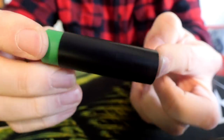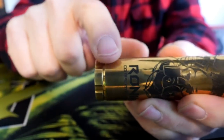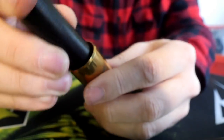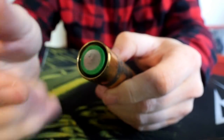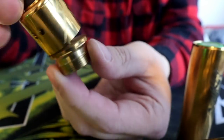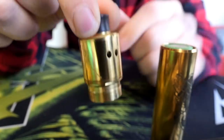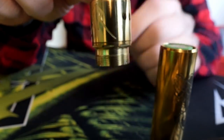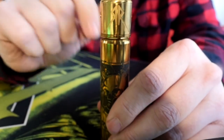The one exception to always running batteries right side up is if your mech mod includes a protection sleeve — whether plastic or delrin — to protect that battery wrap. With the Ronin's nice threads, screw the switch flush, press that delrin piece all the way down into the tube — it's a very snug fit — then drop the battery in positive side down. The delrin ledge physically stops the battery from coming out the bottom; it can only come out the top.